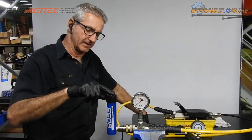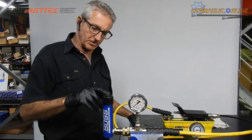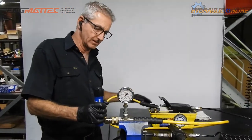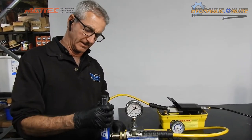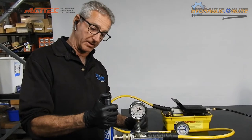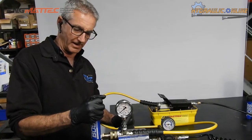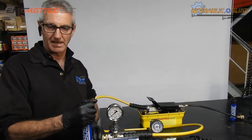This cylinder is rated up to 10,000 psi, and internally there's a little extension spring so that when you release the pressure, the extension spring — which has been stretched as the piston comes up — will actually pull the cylinder back down. So this whole system is called single-acting. It's a little press cylinder or lifting cylinder. This is a one-inch lifting cylinder, so it'll actually lift almost 8,000 pounds — about four tons — if you put 10,000 psi into it, and obviously if you put 5,000 psi it'll lift two tons.